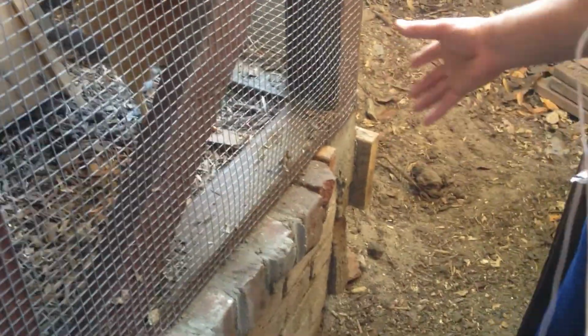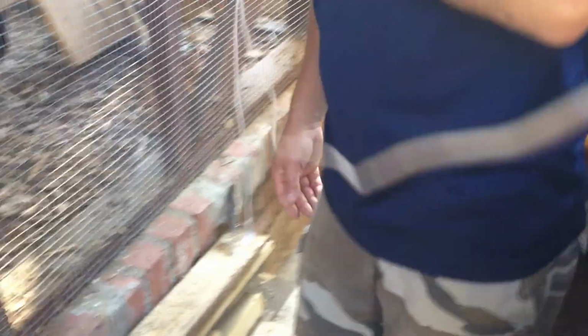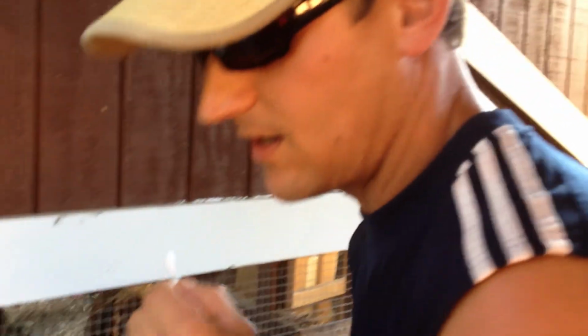We also had to shore up the wall. And yes, some of the foundation had completely crumbled, which we had to build a form for the foundation and re-pour concrete there. Okay, what was the next step after that? Well, that's what I kind of jumped, but it was the sill plate, I guess. You would call this a sill plate for the chicken coop. We just bolted that down and then started putting in the uprights.